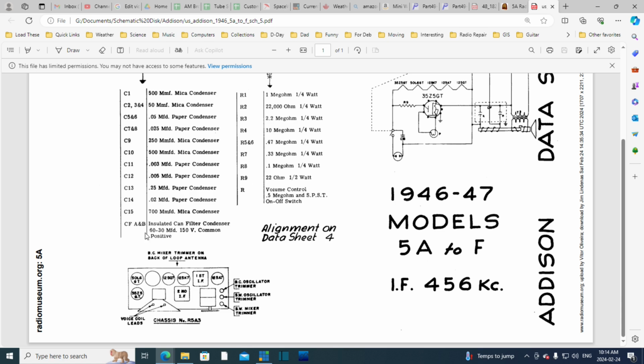So which one's 60? If it's A and B, 60/30, A put 60, it put 60 on the front. So the 60 is right on the tube. If you put a big enough capacitor here, you'll have trouble because the charging current charging up the tube is substantial. There's nothing to slow it down. So you put a huge demand, or even cause a short circuit to develop inside this tube.